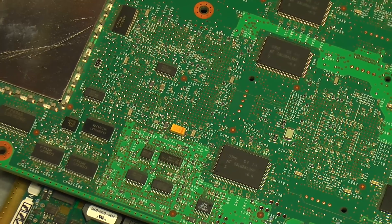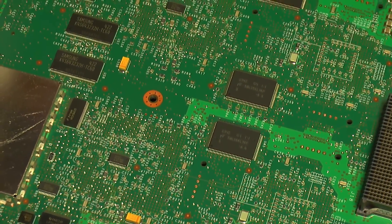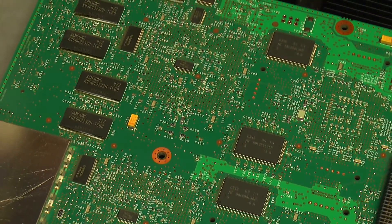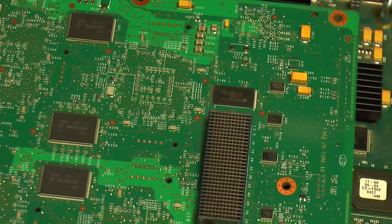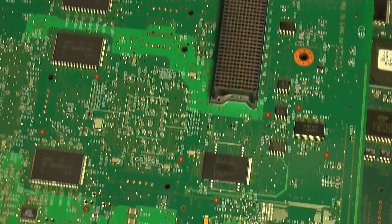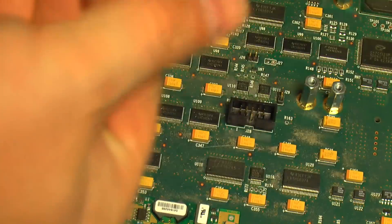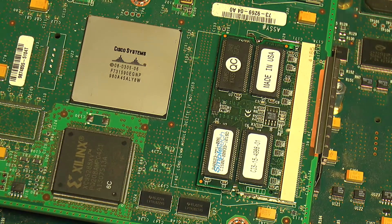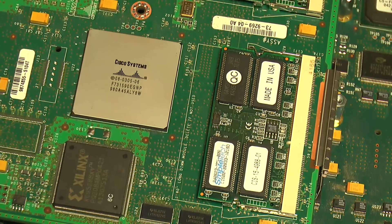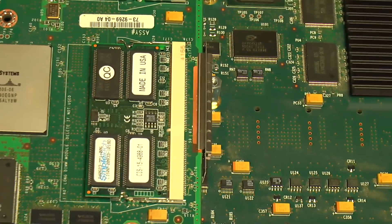Plugged in on the left-hand side of the motherboard is a multi-layer switch feature card or MSFC — in this case an MSFC3. There's some Samsung RAM on the bottom, together with some static RAM made by Micron and by Toshiba, and there's a bit of AMD flash memory as well. Over on the top side, you can see we've got some half-gig memory modules, another Xilinx chip, and one of the two identical Cisco CPUs on the card.